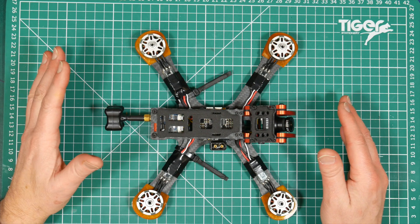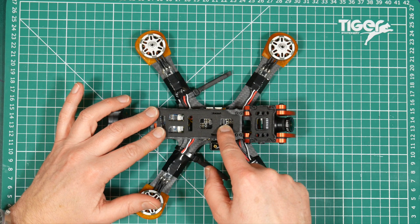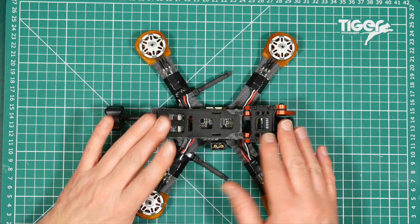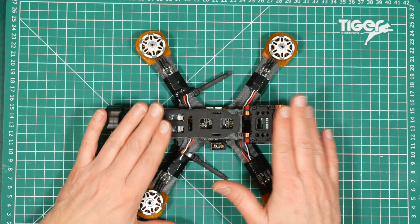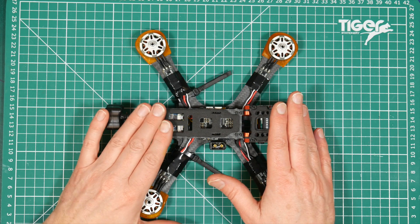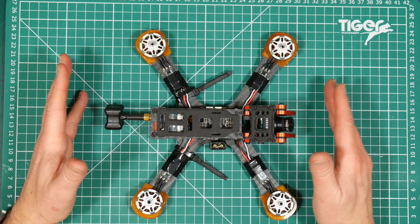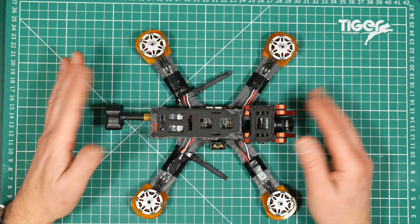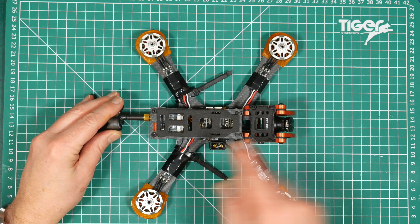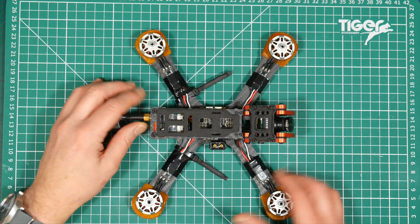The purpose of this video is to show how to flash Butterflight onto this flight controller, but also to show you how to safely back up all the data and configuration you've currently got on this machine so that you can go back to where you were - basically rolling everything back. You would think this would be pretty straightforward, but in actual fact it's problematic and there are a few pitfalls. So the first thing we need to do is find out exactly what version of Betaflight is installed, so let's get this connected to our computer.